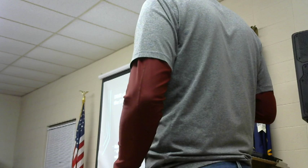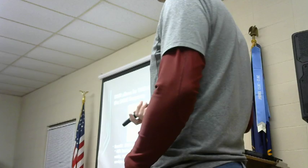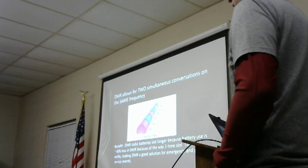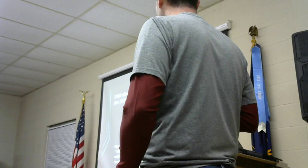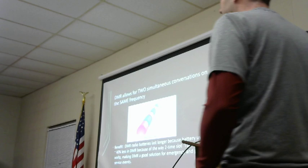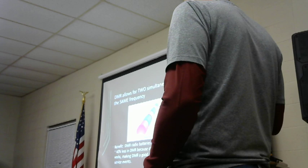So here's where we talk about the two time slots. Time slot one's on, two, one, two. You can be on the red time slot one talking, and then someone else can be on the other time slot two. One of the big benefits, and I didn't really think about it until I started using DMR, was battery life on your handheld radio. Because you're only on and off, you're transmitting literally half the time. It does make a big difference. I guess you've seen that with your radio, the battery life. I go like 4 or 5 days on that. So that's a good thing to know. If you're working with ARES on a bike ride or the MS, if they were using DMR, that'd be a good benefit.